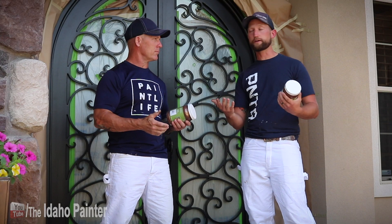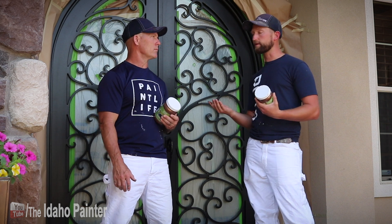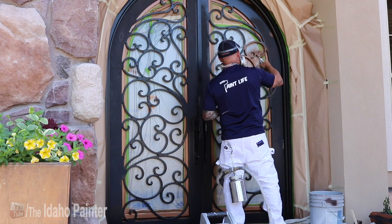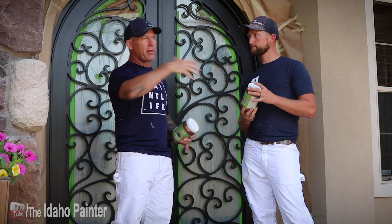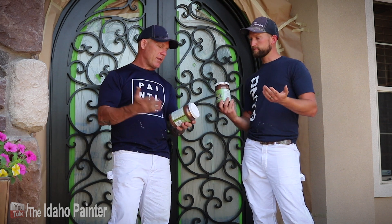The reason they tell you not to use an HVLP turbine is because it shears the sheen just a little bit, so your sheen is going to cut back slightly. But it's going to give us a better finish in my opinion and it's going to be easier to touch up. With this product, if you brush it one way and then back the other way you're laying the flecks out differently and it looks completely different — spraying lets us get into all those cracks without those same issues. Since we're top coating with two clear coats anyway, the sheen our product ends up with will be the sheen of the clear coat.